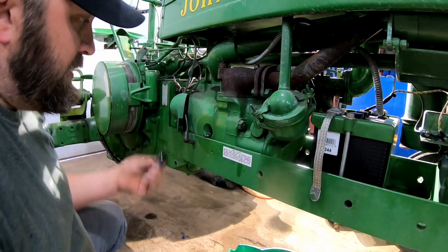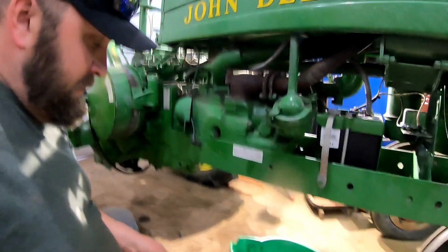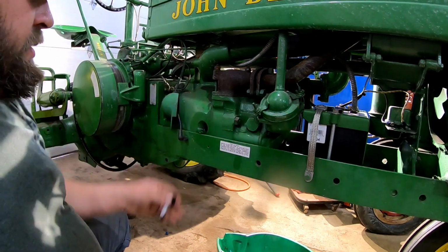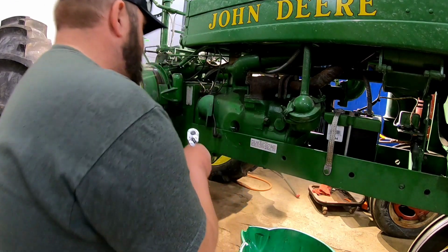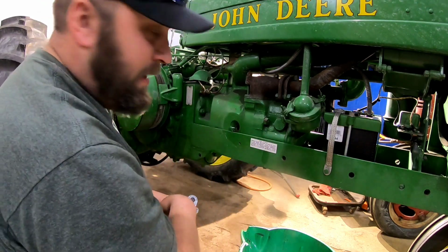That one is full of gas, so that's why we check, because otherwise this cylinder hydrolocks and that's not a good thing. So that valve was open, would have caused us a problem. So because we got the spark plug out, I'll pull the other one on the other side and then we'll whip this motor over to blow that fuel out. We want to put our spark plug wires back away so we don't get an ignition and create a flamethrower. You'll probably see some pretty good fuel fly out that side, I'm guessing.